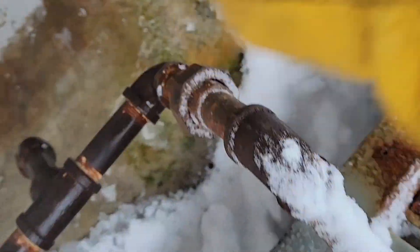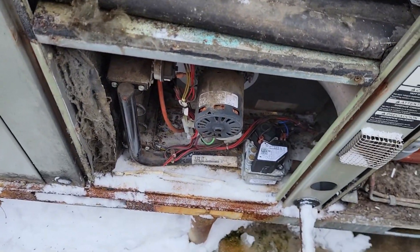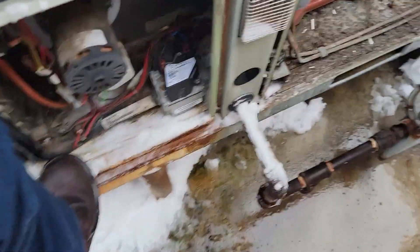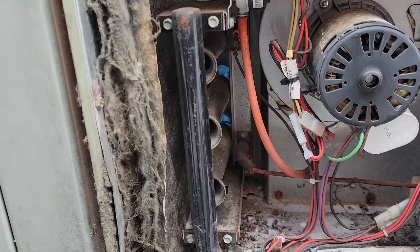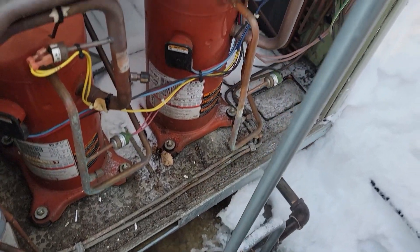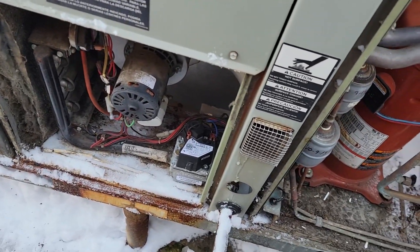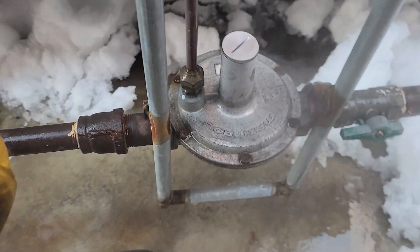Let's get this thing back together, get her juiced up and see what she does. There goes the draft motor — hopefully. Put on the lower door. The regulator's frozen again. It's working now — I poured hot water on it but it froze up again. I've got heat tape for 120 and 230 volt, so we might just run some heat tape up to the regulator up there. Yep, there it goes again — that sounds a lot louder that time. Just ain't a whole lot to hook it up on around this thing — that's nothing more than a bracket just to hold it.